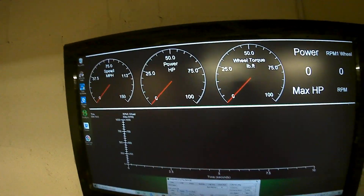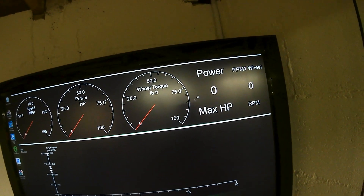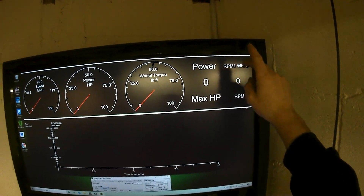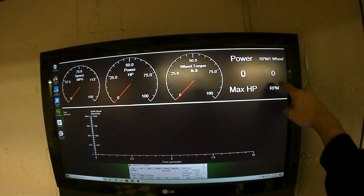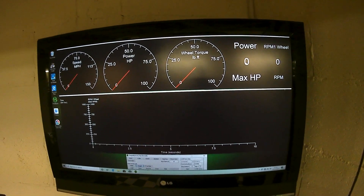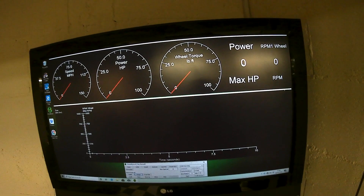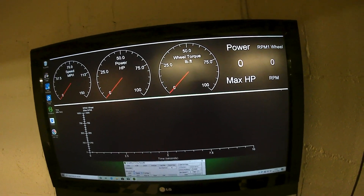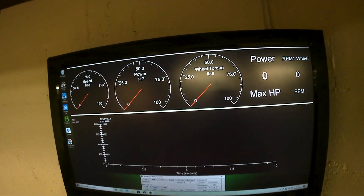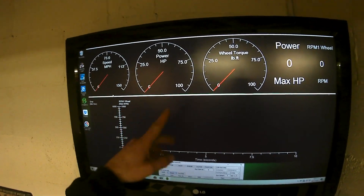Double-clicking on the icon lets you remove or change the colour of the background and labels. I've got it set up with max BHP, the RPM of the roller, and believe it or not, when we calculated that dirt bike doing 70 miles per hour, the actual RPM of the roller was only 700 RPM - I was shocked how low that was. I calculated that the rolling mass's safe working spinning diameter before, when it was actually in a motor, was nearly 1800 RPM, and I reckon it'll do nearly 2,000 to 2,500 without any trouble. So we could easily do over 100-150 mph without worrying.